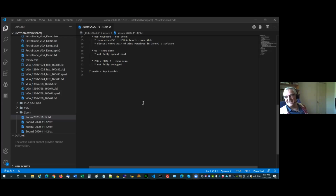Yes, exactly. Before I can search to see whether there's a valid file on the SD card, I've got to reset the SD card, initialize it, and that can take up to 300 milliseconds, and classically takes 200 plus. Okay, what would be a worst case time I should allow for? I allow for a second in my time. I haven't seen any cards go over the high 300s. It doesn't mean that there aren't any.